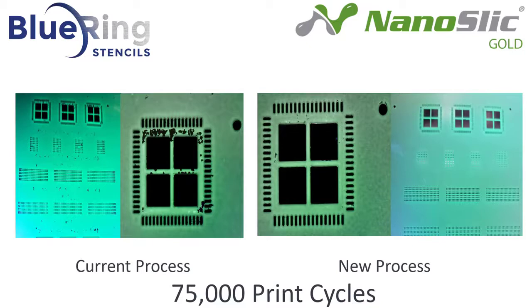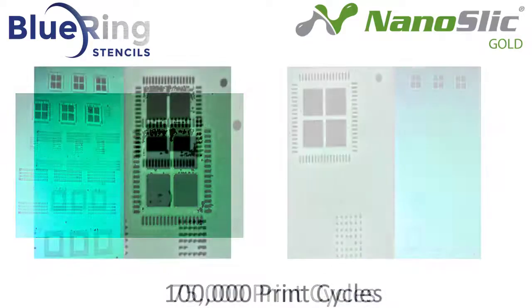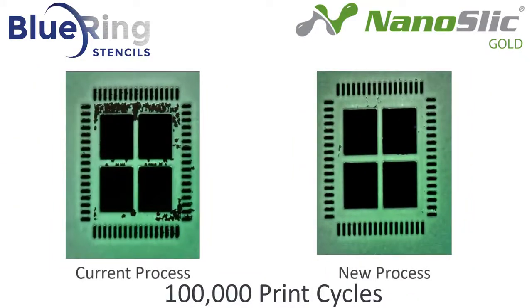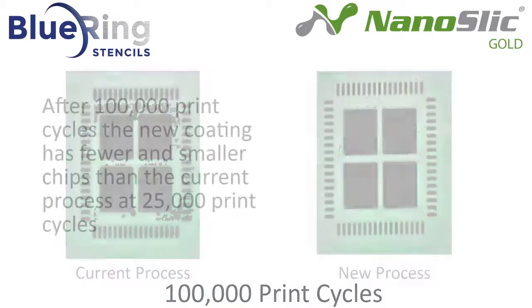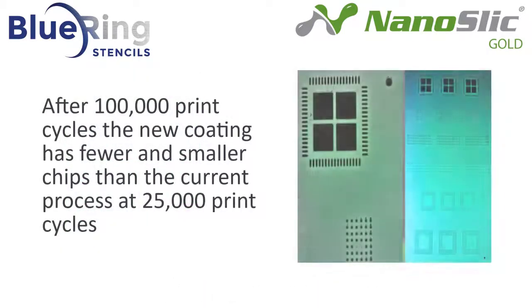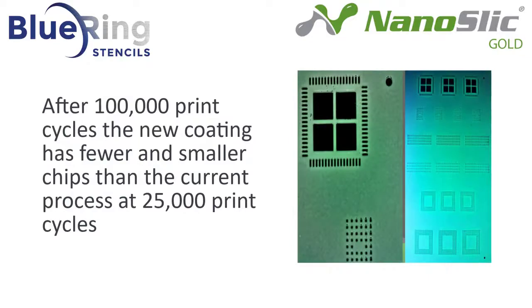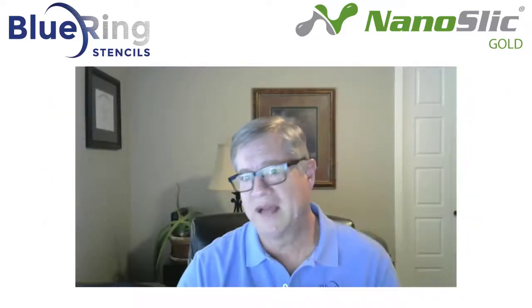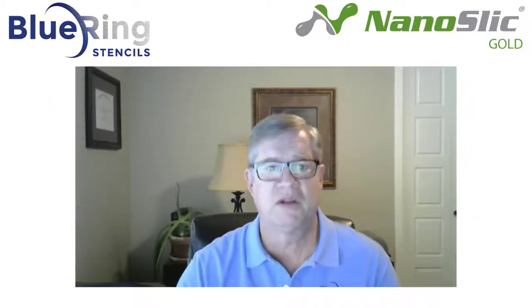The differences are dramatic. The last slide we'll look at here is after 100,000 prints. The current process coating has worn out, and even after 100,000 print cycles, the new modified surface coating is holding up very well. After 100,000 print cycles, the new modified surface coating has fewer and smaller chips than the current process at 25,000 prints. Beta site testing has also been underway over the last 6 months with tremendous results.